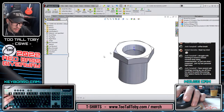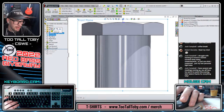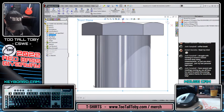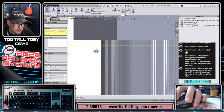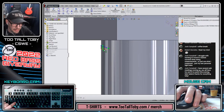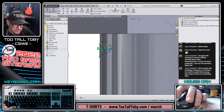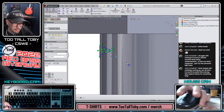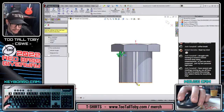All right, and we are... Oh, I forgot to put in the thread, the pseudo thread. So let's add a little pseudo thread here. This one. Remember, when it comes to creating things like thread, you can certainly do it as a helix, you can do it as a cosmetic thread. You can do it the way that I'm doing it here, which is to just create a representation of the thread so that if somebody is looking at it, they know what they're looking at. They know that this is supposed to be the thread for the hex nut that goes up top.